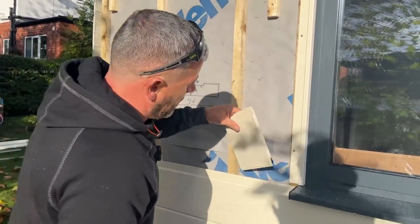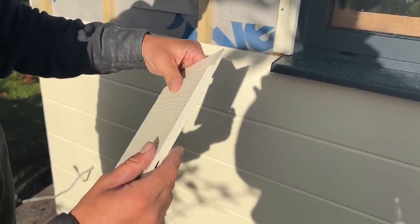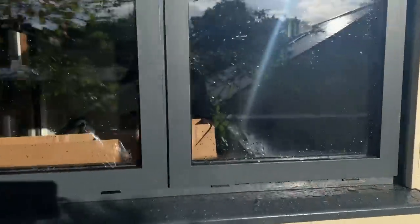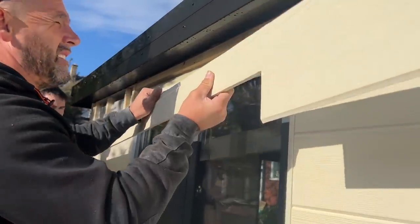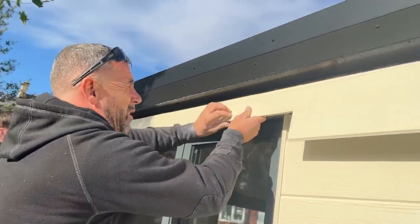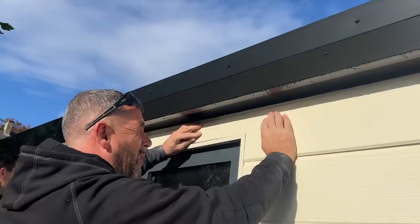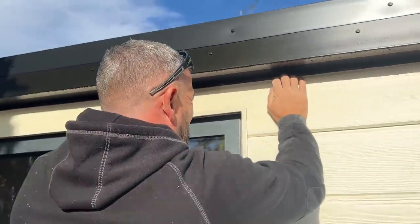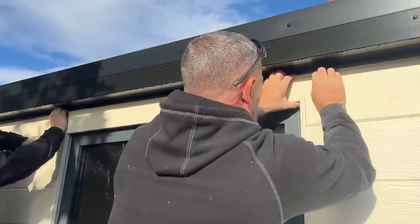The end, is this an offcut? It is there, look. See, that's come from the factory, and it's already been painted the same colour, and it's sealed. So like I say, we'll cut a piece there, that'll drop in there, and vice versa on that other side as well. Right, so we've cut the section out of there. Davey's then painted it with the colour-coded paint, and because we've got a pitched roof, I've obviously scribed it to size of the roof. So that now wants to come down there a little bit like that.